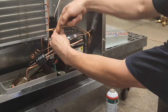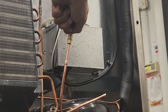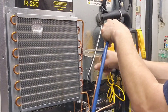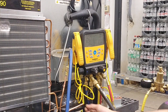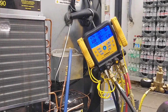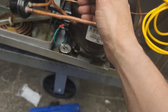I try not to put too much pressure with my spinning blade and I like to spin it a lot more than most people do. I pull out my little valve stems, get them both ready, and before I do anything I want to flow a little bit of nitrogen into one side so I don't take any chances of R290 catching fire — because I don't like explosions. I'm running a little into the suction side on my blue hose. This makes me feel better about igniting my torch. Just a little nitrogen and let it bleed out.